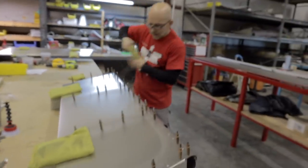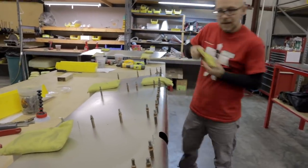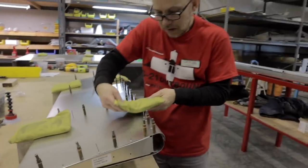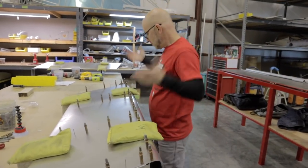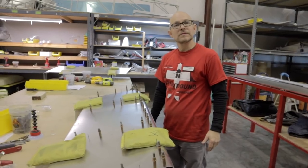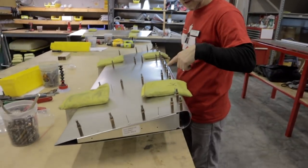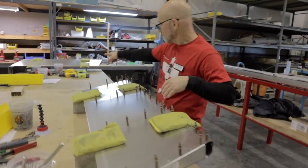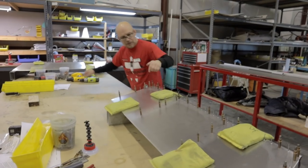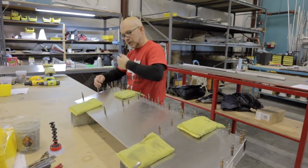Okay. Then we get this guy here, and then this guy here. At this point, you can rivet. Rivet the empty ones that didn't drop in easily. Rivet all these, the ones that didn't get a rivet. Then after it's riveted, drill with a number 30 size bit with this guy, just to clean the hole. Rivet that one. And then we'll come back and we'll start exchanging.